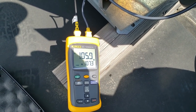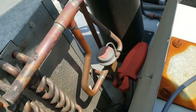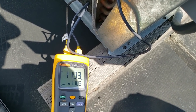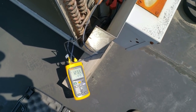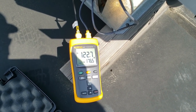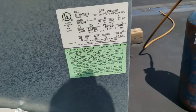This is my liquid, and this is the hot gas. In reality, if it's deadheaded in there, it shouldn't be traveling down here getting hot. The liquid coming out is at the same temperature going through the valve — so our liquid coming in and going out is the same temperature, basically just hotter than heck. This right here is going to be our hot gas, running 170-something. So our headmaster is not acting up. We've got almost 80 pounds on 404A — need to convert that to my chart because I don't remember exactly what that comes out to.